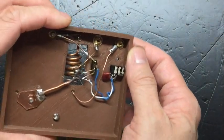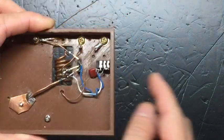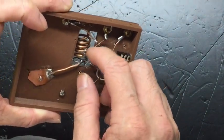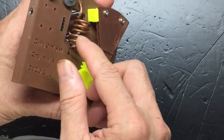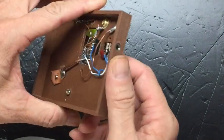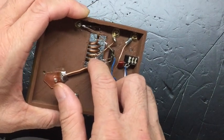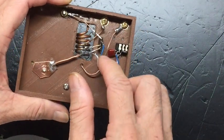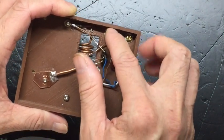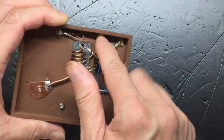Okay, and then the second antenna, which is this screw here, this point here, the second antenna we need to connect to the second turn of the coil. So this is the first turn, right? Excluding this thin wire here, this is the first turn, second turn. So we need to connect that to the second turn of the coil. And this second turn will connect to the other antenna terminal. So again, this will be the second terminal of your Yagi antenna or a second telescopic antenna.